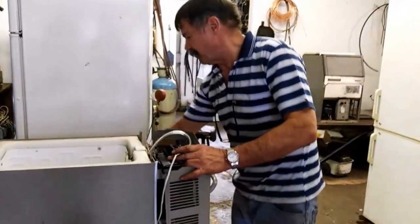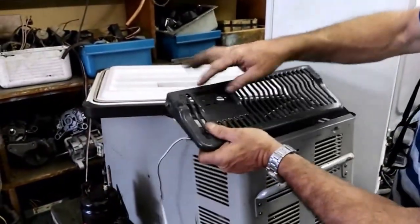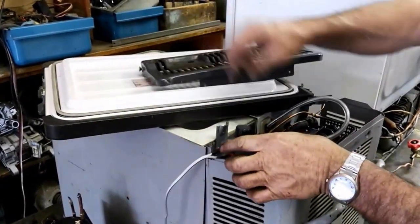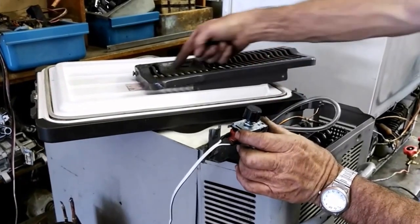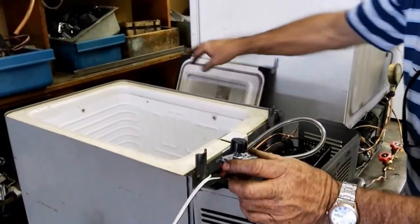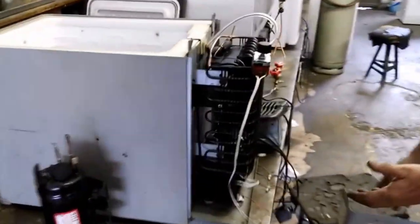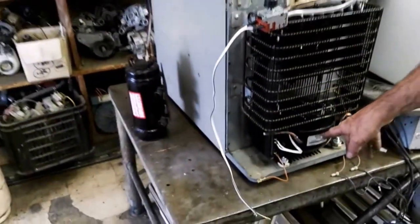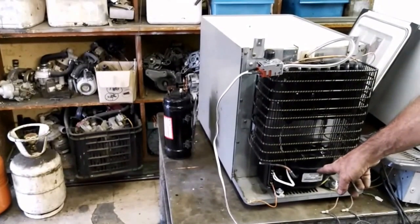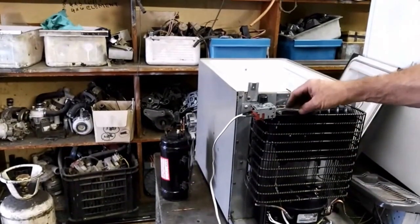And this thermostat, when I mount it, I'll put it in the same place where the original temperature controller was, with a little plate, and I'll mount it in such a way that with this knob the numbers line up as well. So once it's assembled from the outside, you won't know that this Engel has been modified, and the cost saving on this compressor is 1/7 of the price of that compressor, and this is probably half the cost of the Danfoss. So we modify them like this.